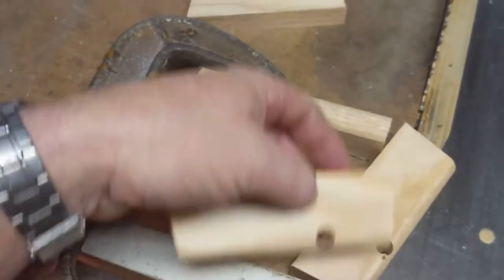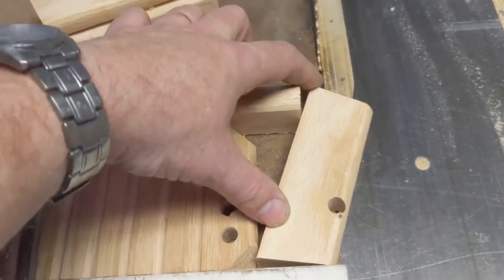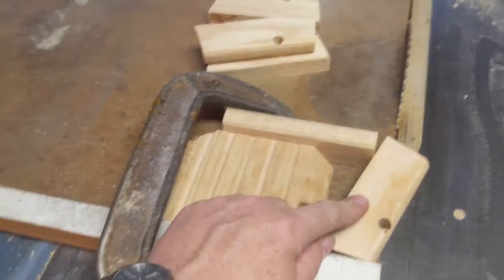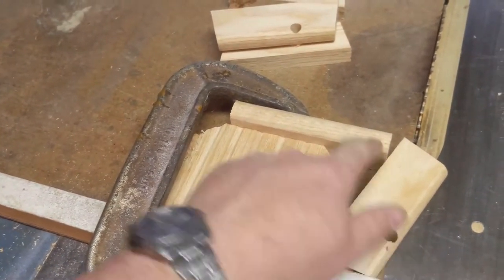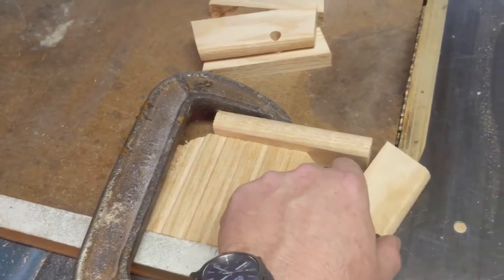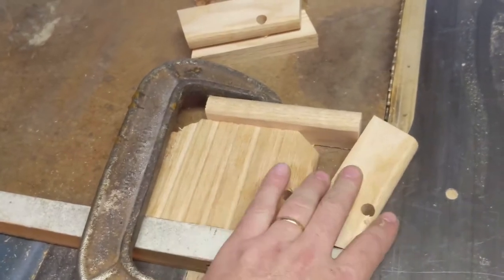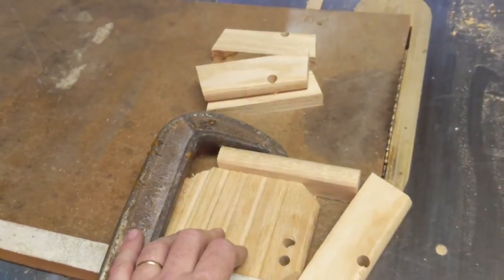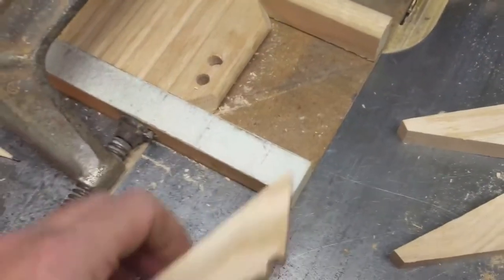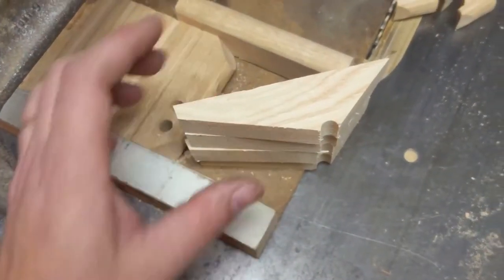Using the drill press, I drilled the hole at the same location in each one, just using a little stop to locate it. Now I want to bevel it off to basically bisect this hole and then taper to the ends — this happens to be the back taper. It's pretty simple to do with a quick jig: the sliding of this piece determines how far over it's angled. I just literally hold the piece visually in place where I want it, clamp it, and now it will produce all four with the exact same cut. Then I'll flip it around, figure out the angle I want on the other side, readjust the jig, and cut all four that way. That leaves us with four perfectly identical bolsters — I'll call these a bolster — with the slot for the brass rod to lay in to locate against.